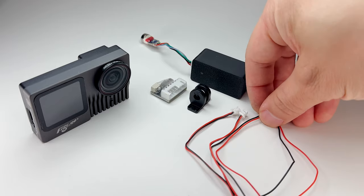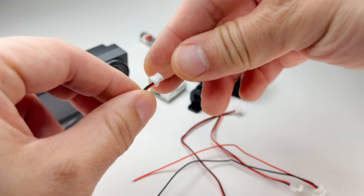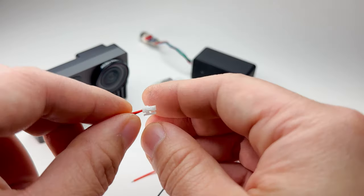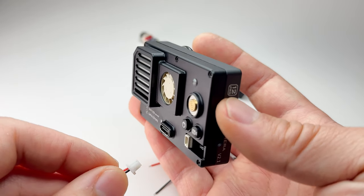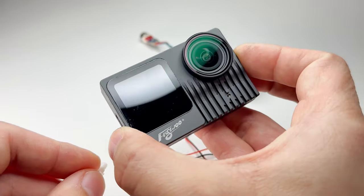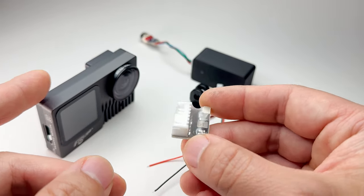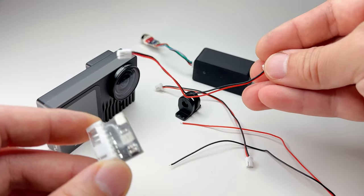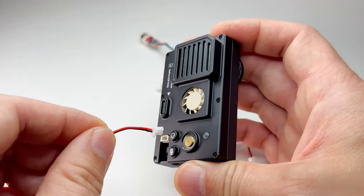The kit comes with a bunch of power cables. Two of them are open-ended, perfect for soldering directly to the positive and negative pad of your flight controller. It also comes with these plugs with a little tab that makes them harder to pull out in an accident — once plugged in with your LiPo, you'll have power to this directly from the flight controller. There's also a balance plug adapter to power your naked GoPro from your LiPo's balance plug, and the kit comes with two of these, each with two ports.